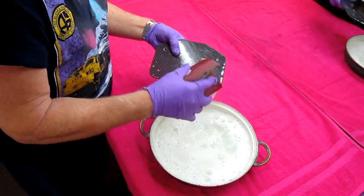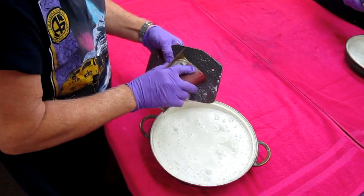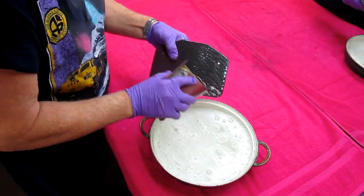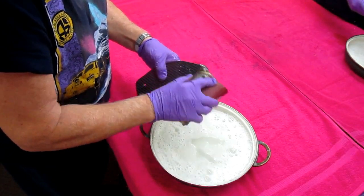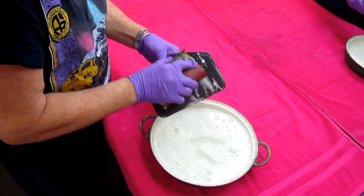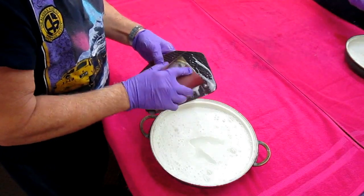Now, when they're really, really deep, it requires a lot of work, but I try not to be tempted to use a rougher grit, because then you spend a whole lot of extra time, and I mean a lot of time sometimes, getting out the sanding scratches, where with 2000 grit, when we go to buff this with our product, 8065, once it's flat sanded, it comes up very, very easily.